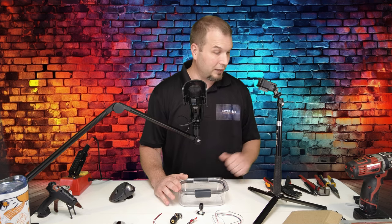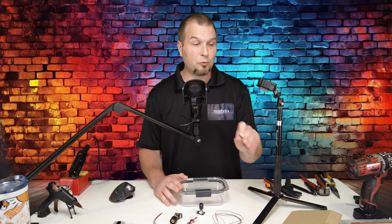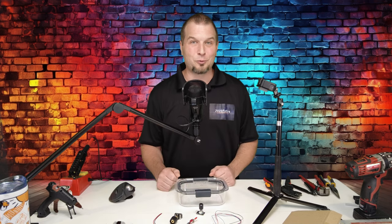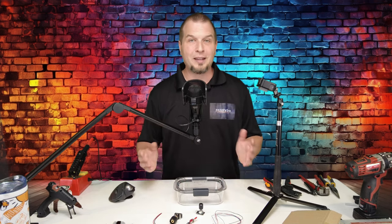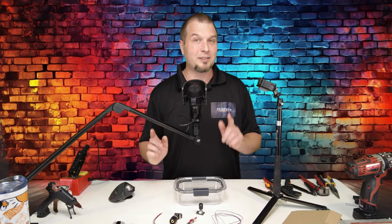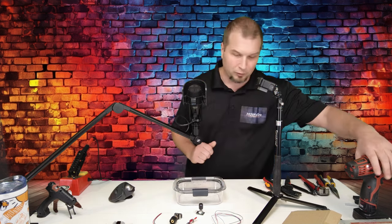Now that you have it taped, you can then take your drill bits that you use to make those holes and just simply drill right through the same hole that is in the cardboard. Now, for the sake of time in making this video, I am not going to be doing any sort of templates. What I'm going to do is just drill some holes in here and hope for the best. But when you're putting a lot of time into this, you really want to make sure that you test, test, test before you drill into your main material. So let's do that right now.